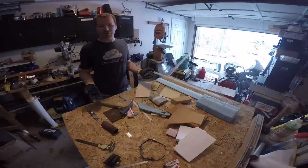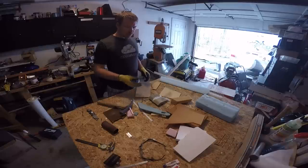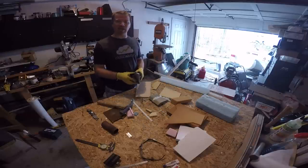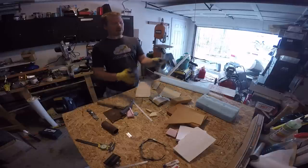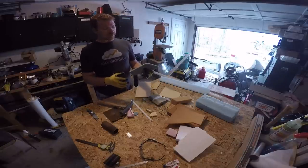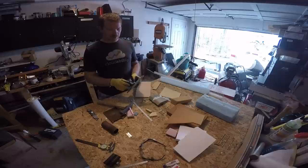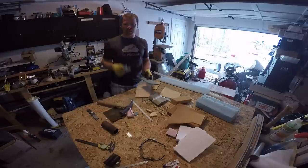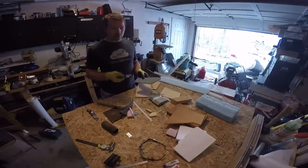So lots of different kinds of foam — hope this was informative. If you're looking to get into fiberglassing and have never done any before, I would start with three-eighths PVC material. You can make almost anything out of it: glue two pieces against each other and do fiberglass layups around them to make all kinds of crazy shapes that are waterproof, never rust, last forever, and have a lot of strength. It goes real quick — it takes five seconds to make just about anything.